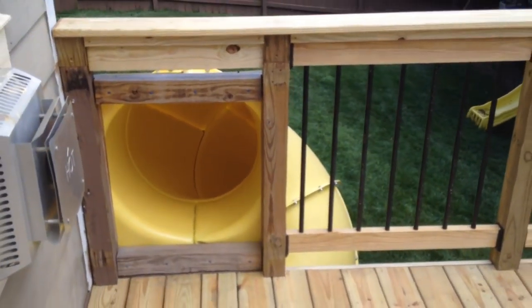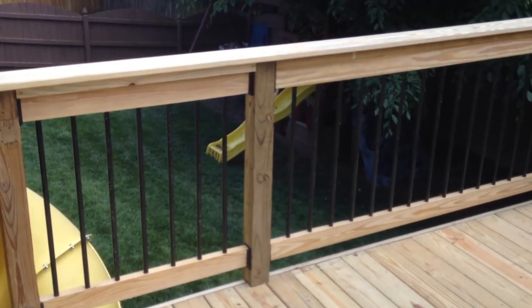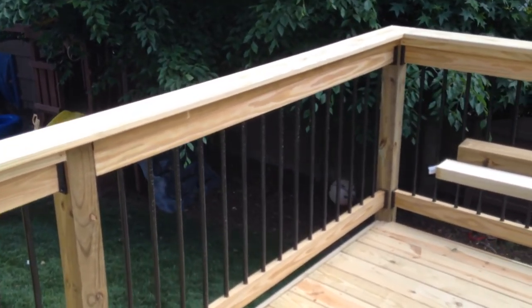What do you think? It took a little creativity to put this all together because of dealing with the old construction. But that slide down there basically created another set of circumstances because everything was exactly four inches too short. So I had to build that quarter up — four inches — put two toppers, just four-inch pieces of four-by-four on top of the four-by-four, glue it in, screw it in. And then I had a level playing field to make this whole thing level and straight. It took a while to figure out, but I finally got it. I think it came out good. Homeowner said she loves it, especially now it's taller. And once it's all painted nice and black, it's going to look good — I think it's going to look real good.